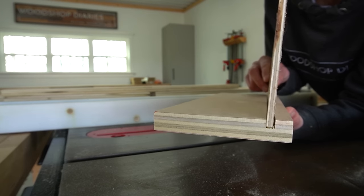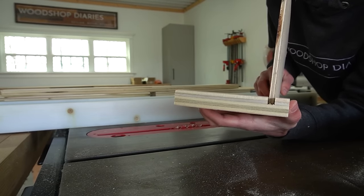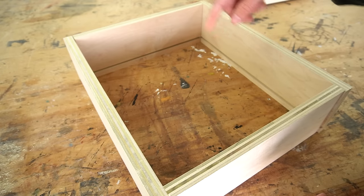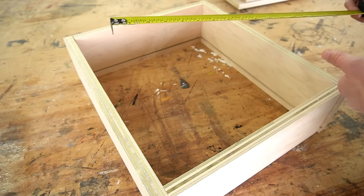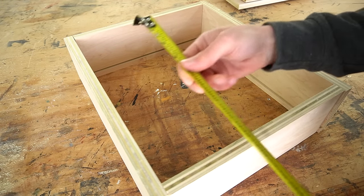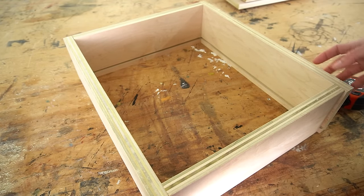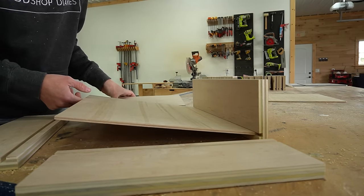If your plywood panel is a little loose in your dados, that's totally fine — for drawer bottoms it's not critical that it's exactly a quarter of an inch, just as long as your plywood fits. Now I need to cut the plywood bottom to go into these dados. Since the dados were cut a quarter inch deep, I take the inside opening dimensions and add a quarter inch for each side — a half inch total. So the inside width is 12 and a half inches, making the bottom 13 inches wide. The inside depth is 14 and a half inches, so I'll make it 15 inches deep. If you're not installing the bottom into dados, just cut the plywood piece the exact same width as the overall size of the drawer.